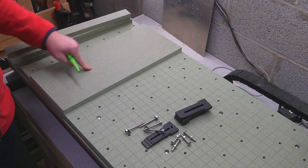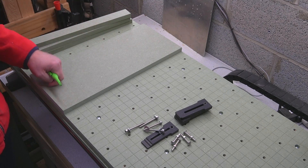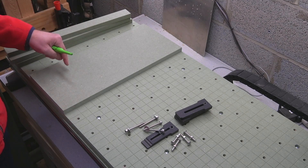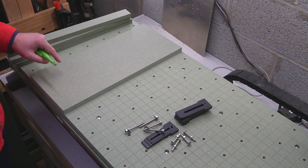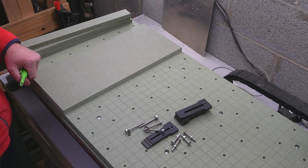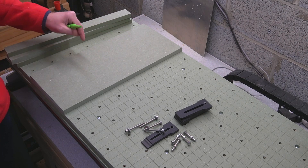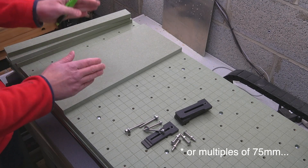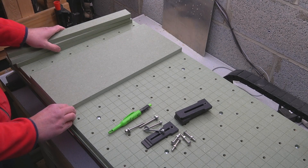We are sure that what we cut off here is exactly square because it's cut by the machine with the piece in the exact position where it will be when used as a jig. We will use a zero point somewhere here and write down the absolute coordinates of that point — it will be the zero point later when we use the jig. But for now we're just going to drill holes at 75mm intervals to attach the jig to the wasteboard, then attach the jig with its definitive screws and cut the rest so it will be exactly square.